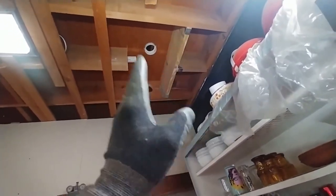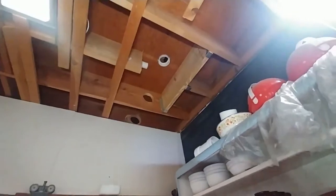Anyway, we'll get this one in and that one in, all with joist hanger hardware on it again, and then that will support the plywood in as well as it's been supported elsewhere in this floor system, but it'll turn the joist in this location in the right direction so that we can run our 4-inch line, and then that'll come over here. Now when we get over here, let's see if I can take this piece up.